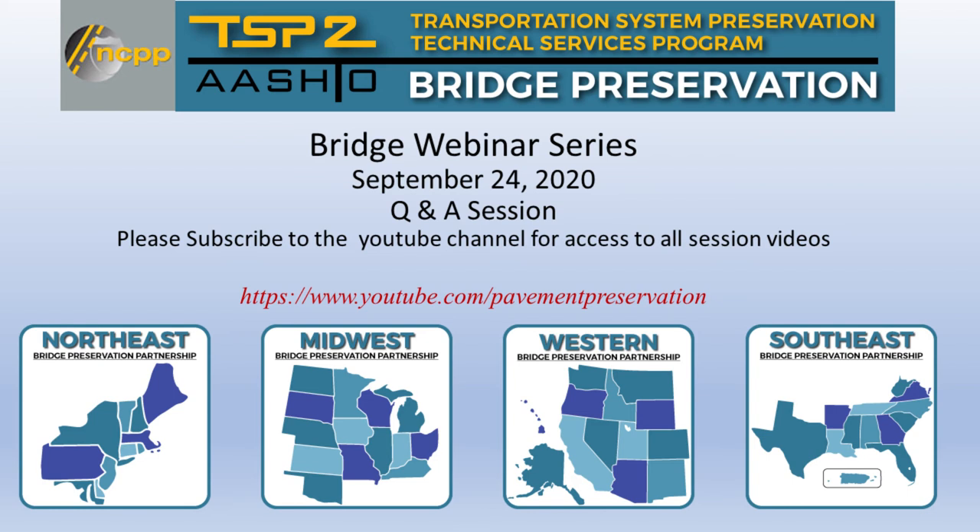For both thin polymer and PPC, how soon after application of these overlays would you place traffic back into operation? With thin overlays, it varies because it has to do with temperature. Most epoxy systems are dependent on temperature for the curing rate — sometimes you can cure them as fast as three or four hours, sometimes six, eight, or more hours. With polyester polymer concrete, it's adjustable. Typically we shoot for two hours return to traffic time, sometimes pushed to four hours, but it's usually in that two to four hour maximum range.